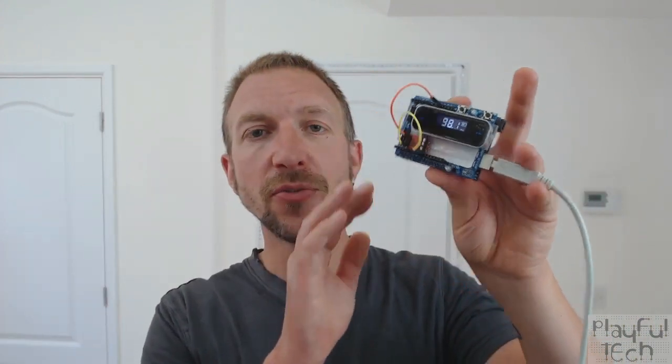I've got that sketch running on the Arduino with the FM transmitter set to broadcast on the selected frequency. Now I'll take my pocket radio, turn it on, and try to tune to that frequency. Scrolling through stations I pick up others on the way — and at 98.1 there we go. You can hear the Morse code broadcast. It's a looping message, so if you pick it up mid-way you simply wait for it to loop back to the beginning.